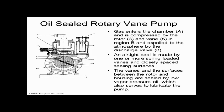In your car, like a V8 or a straight 4-cylinder, the piston doesn't hit the cylinder wall. There'd be so much friction it would damage your car, right? So your piston never hits the cylinder wall. There's always a layer of oil. That's why you put oil in a car. That makes the seal. So you have the piston ring made out of metal. You have the cylinder wall made out of metal. And then they don't hit each other. There's this very thin layer of oil in there. But that oil acts as a seal.